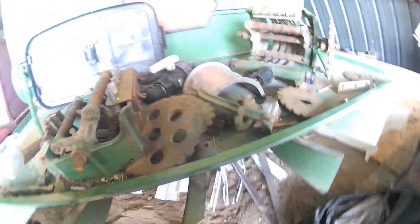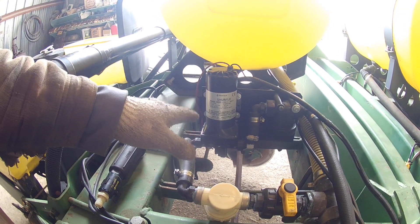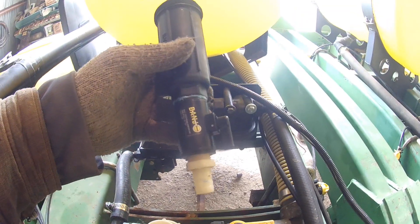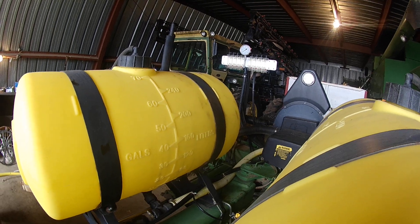When I found out this one was broke, I thought, well, I ain't gonna replace that - I'm just going to abort the squeeze pump idea and go a different route. I went to an electric pump - this is a 5.3 gallon-per-minute pump. Here's the supply: this yellow hose and black hose. The supply comes in, runs through a 50-mesh strainer, goes in the pump, comes out, goes into this 80-mesh strainer. I've also put a valve in the bottom so I can drain it without ending up with a handful of fertilizer when I want to clean that strainer. Then it goes through the pump into this supply line, which goes back to that white manifold.